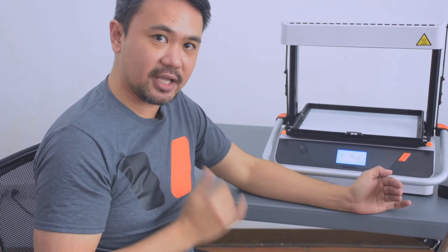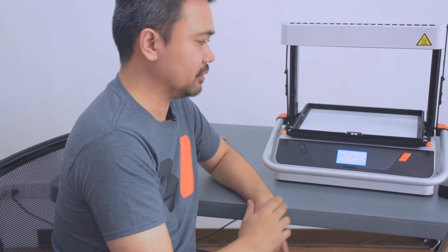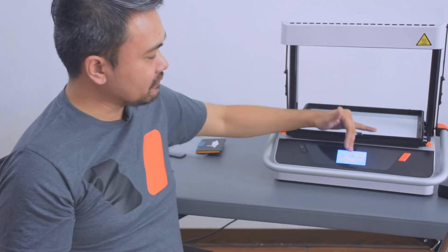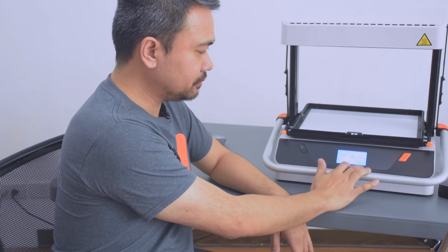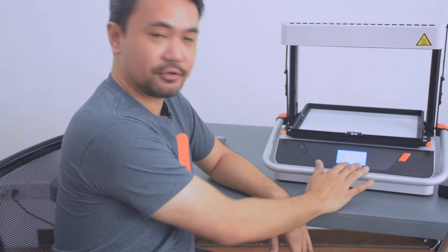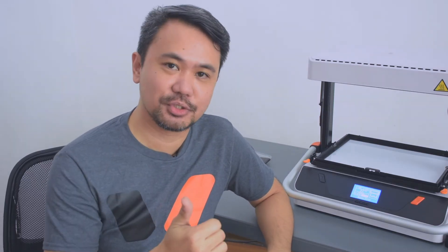So again, to repeat: at either end of the range — a positive or a negative 8 — it's either the first vacuum or the second vacuum that switches on. Anything in between, you are controlling the sensitivity of the switchover, so either a negative value which engages the second vacuum sooner, or a positive value which engages the second vacuum later. I hope that clears up what the V value means. In most cases, you just want a zero value and that should be good for most of your pulls. If you found this video helpful, please hit subscribe and give us a thumbs up. And if you have any more questions, click on the description below and all the links will be there. Thanks for watching.